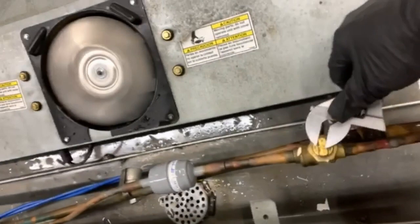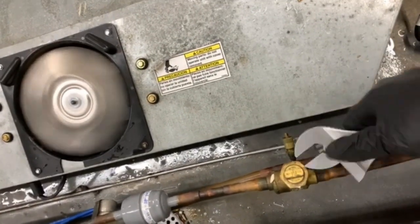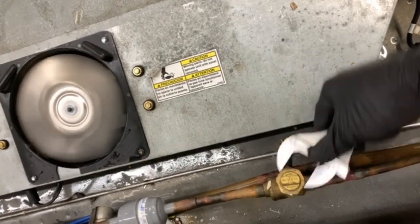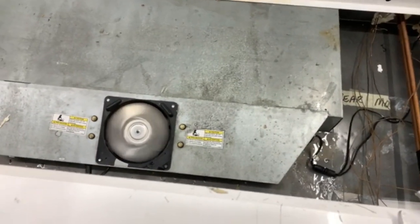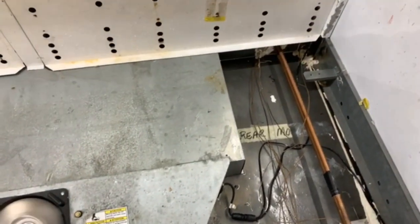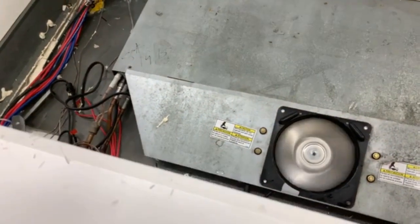If you don't have a nearby water source, then you have no choice but to use trash cans. I got everything together, cleaned up, put my toe kick on. Let's start it up. You can already see the frost starting to build. Yeah, that's going — it's getting cold. I'm gonna put the deck lids back on. Once it gets cold enough, let it cool down for a while, then throw it in a defrost and test all my heaters.